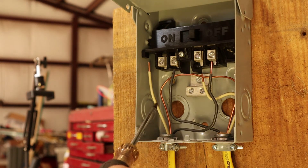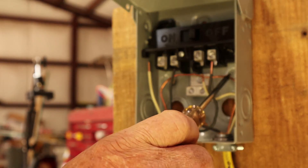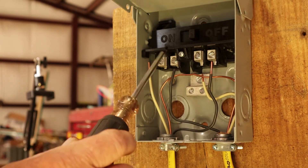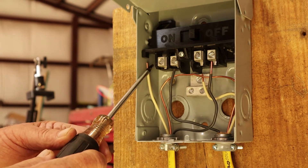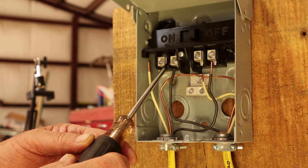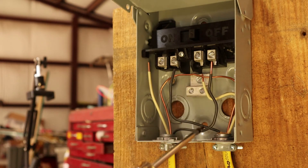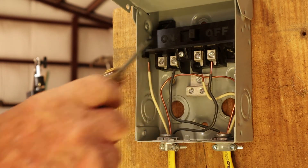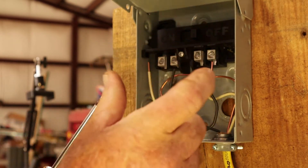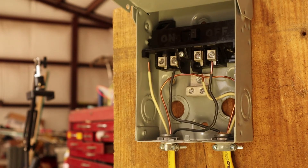You're going to have three wires coming in: a copper ground wire and a black wire on the line side, and the same thing on the opposite side — ground, another live, and then this live. On the box itself, below the on/off switch, it's going to say 'line' on both sides, and 'load' on both sides. Power comes in from the line side and goes back out to the load side. When you flip the switch left to right, you either turn it on or off. This is not a fuse-pull type box — it's just an on/off switch.